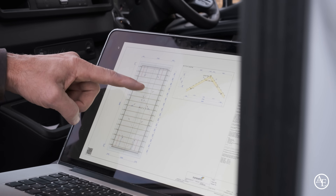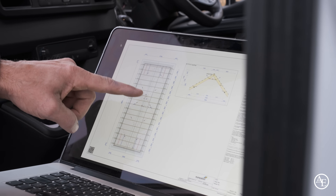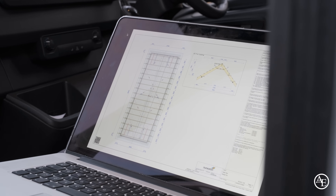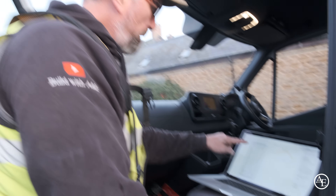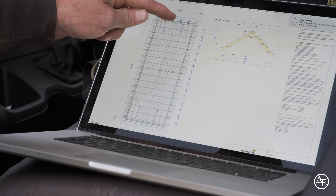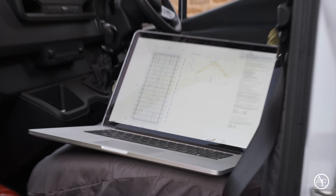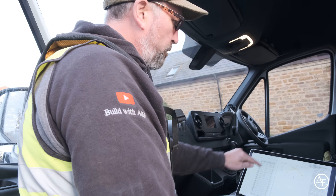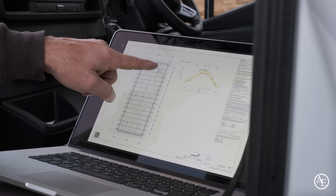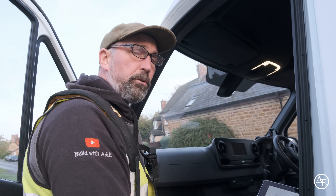The first timber I'm going to run in is the ridge brace. Before I put all the diagonal braces in, I want to make sure all the ridges are at 600 centres as well - it's really important. Me and Matt will get that through first, then start putting all the diagonal bracing in. The last thing is to put the high-level straps and low-level straps on as well. Two days - garage roof on and finished. Let's crack on.